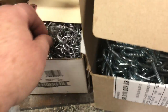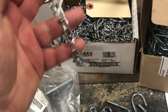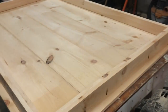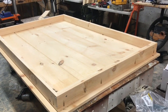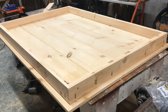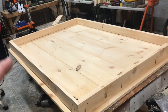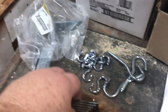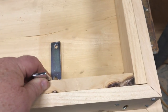Some people are going to think this chain is wimpy, but it has a 70-pound load rating and this panel is probably about 50 pounds. So one chain would have held up the whole thing, but we'll have four — two on each side — and those will be spaced based on the joist.